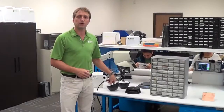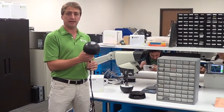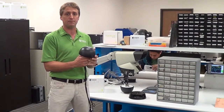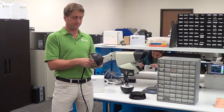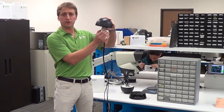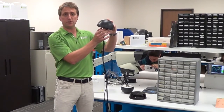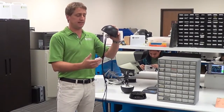The first antennas we're going to test are our popular Pantheon series. These all have 2x2 LTE and GPS, and there are also 4-in-1 or 5-in-1 options with 2x2 Wi-Fi or 915 MHz or Wi-Fi added. They have a very thick thread and nut for secure mounting onto the roof of a commercial vehicle or mobile asset, and they also come with shorter thread and nut options — for example, mounting on the trunk lid of a police car.